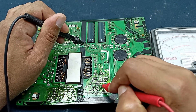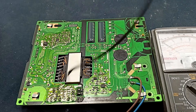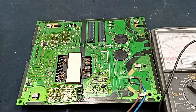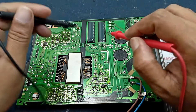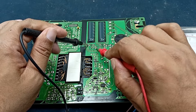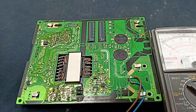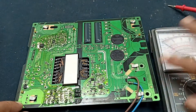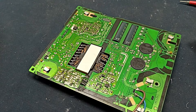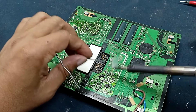Tracing the gate voltage path — no voltage here, here, here — no voltage available anywhere along this line. Unplug the circuit. Let's check if the capacitor is charged. The capacitor is charged, so I need to discharge it. Now I want to open the MOSFET and check if it is okay. Gate voltage and other things need to be verified.